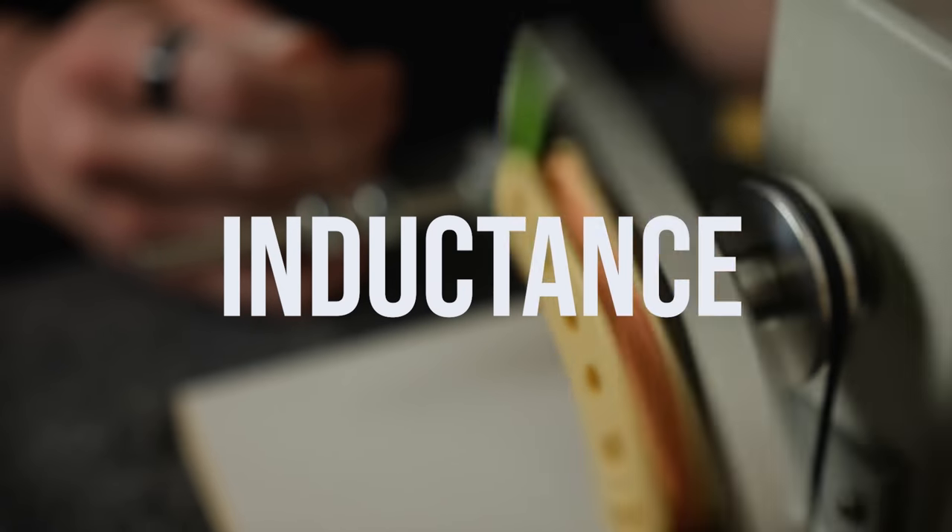We've established that output isn't tone — it's signal level and all of the artifacts that brings when pushed too hot. So what does affect the sound and tone of a pickup? There are a great number of things, but by far the most significant is inductance. The physics behind inductance in a coil can be very complicated, non-linear and reliant on a great many factors. It's affected by the dimensions of the coil, the way the coil is packed together in cross-section, the magnetic flux of the current flowing through the coil and the properties of any magnet at the centre of it all. This won't be easy to explain quickly, but here goes.